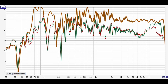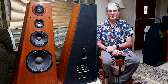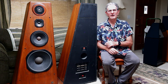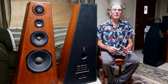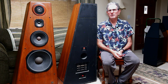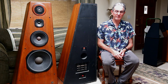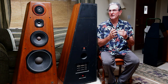While we were unloading the speakers, my buddy Richard mentioned: 'Oh by the way, if you get some voice coil rubbing sound in one of the woofers, just rotate it 180 degrees.' So more on that later. Once I got the speakers in position, I lined up my microphone so that it was one meter away, pointed at the speaker using a laser leveling system. I adjusted the power level going into the speaker to be one watt or 2.83 volts RMS. They are mirror image speakers, and I tried to line up each one in the exact same spot.